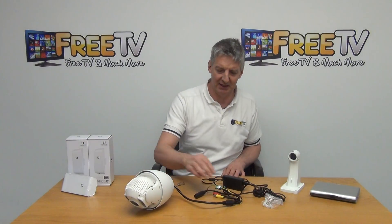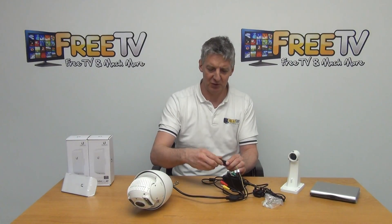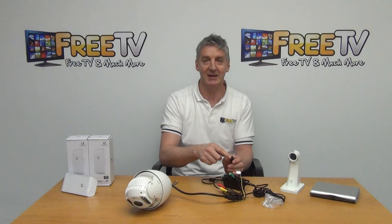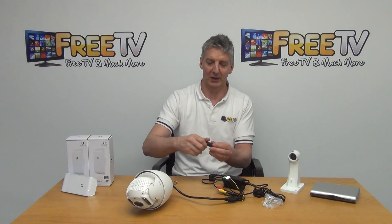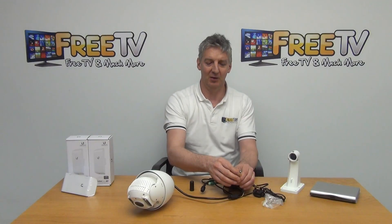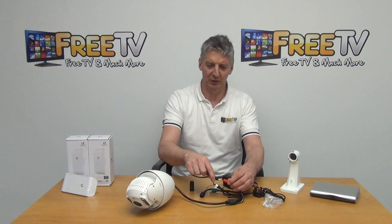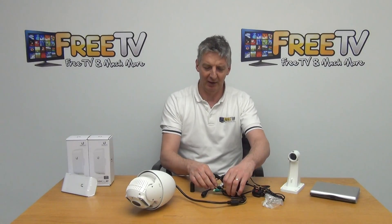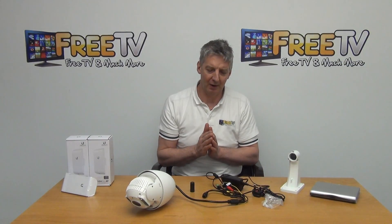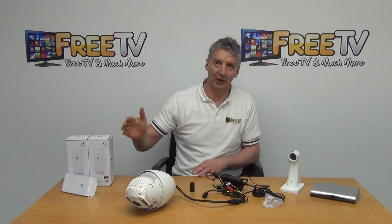What we have here is the main PTZ itself and a range of cables at the bottom. The first thing to note is that we have the ability to put in an RJ45 connection here, so we can have a CAT6 cable plugged directly in, and then we have a water-tight seal that can go over to give the connection we need. We also have an ordinary video output here, particularly if you're using it with a spot monitor, a connection for controlling the local power, and alarm settings as well. So basically we're powering it locally with the ability to control it and send information to a remote location.